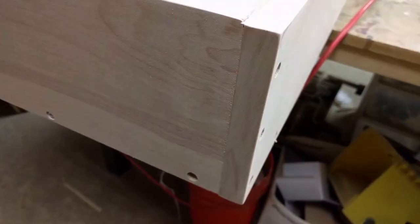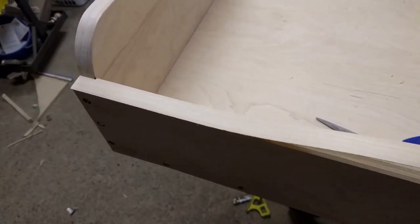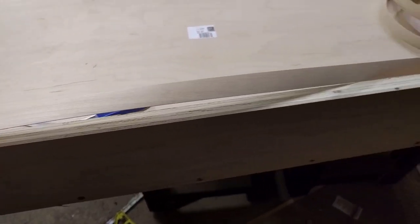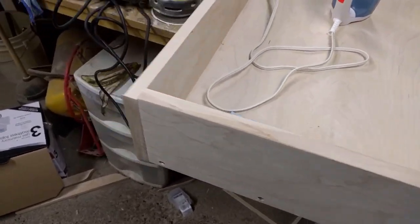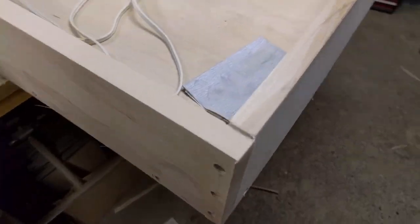I'll even cap the end there — see, that looks like wood on the end too. I've got everything done besides this back edge here, and I thought I'd share it while I was doing it. You just set the iron on its cotton setting, which is about 400 degrees, and you keep the iron moving along. Don't leave it on so long that it'll burn the wood.